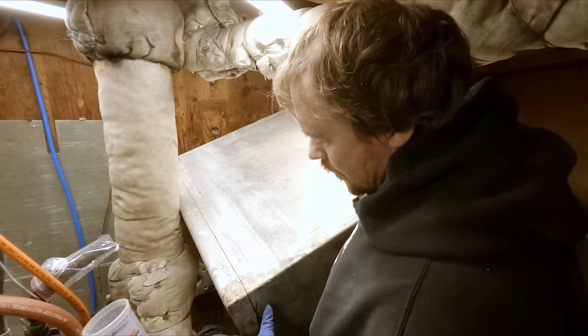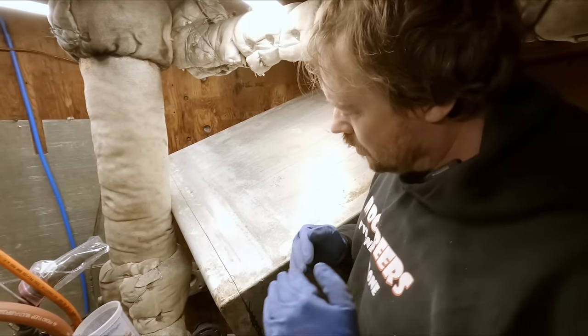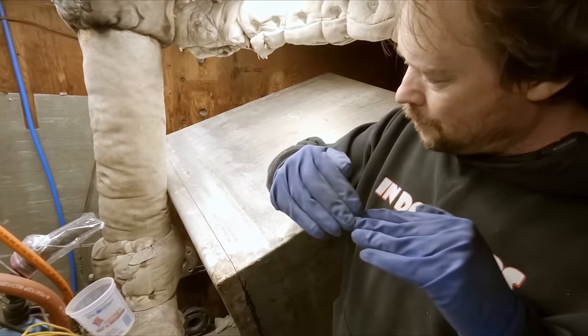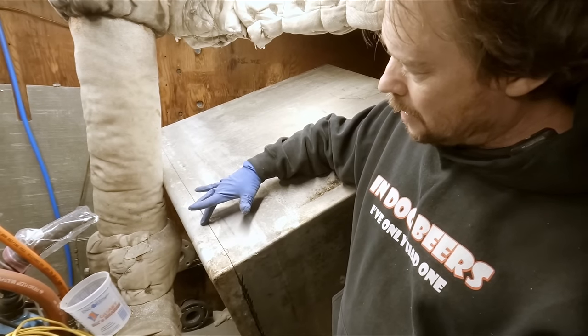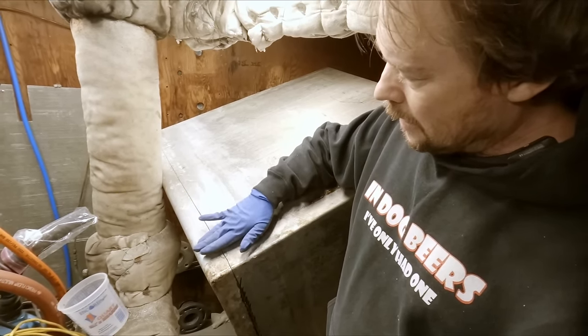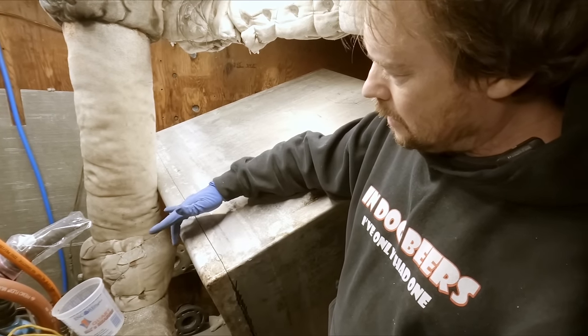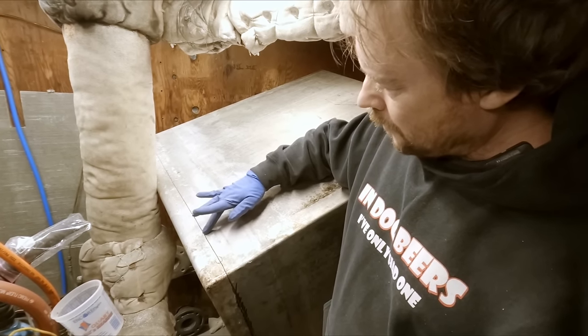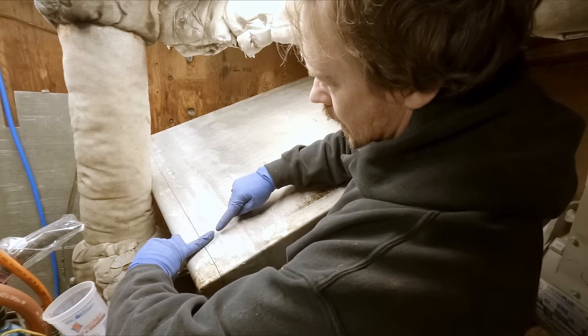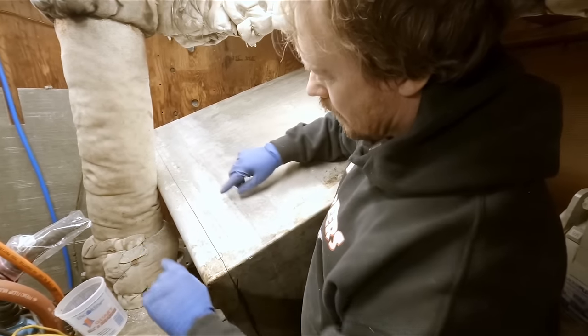I'm thinking what might be the easiest thing to do instead of going in with a butt weld, which is going to be hard to get 100% penetration, we might just go ahead and have our piece bent like this, but make it 3/16 longer on each side. So this bend actually is on the outside here, and then we're just doing a fillet weld across good metal.